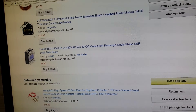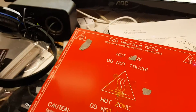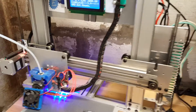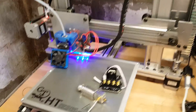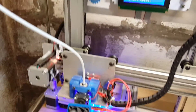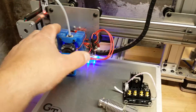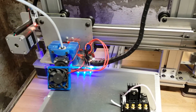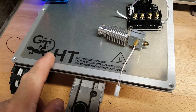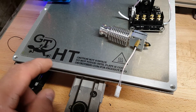I ordered all my stuff and got it in. As you can see, I've already taken this out, so we'll just go over the after-build, which is here. This is my original OrdBot — yes, it is highly upgraded. It has a Bulldog extruder in the back. It's Bowden now; it used to be direct drive. I like getting all that mass off — you can print a little faster. I don't do flexibles on here. I do use Geckotech, which is magnetic now.